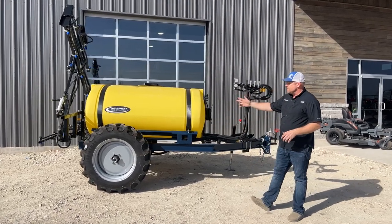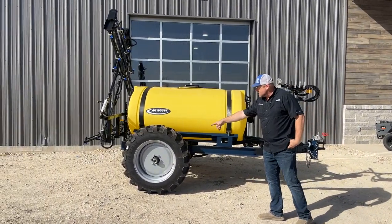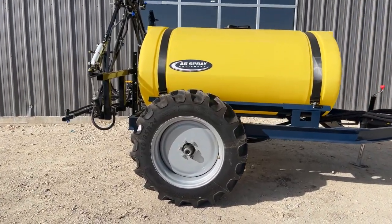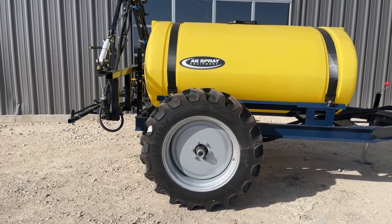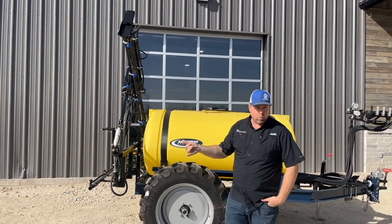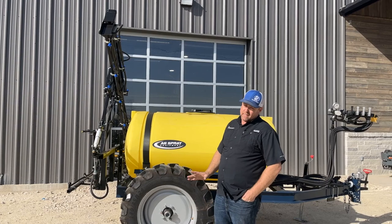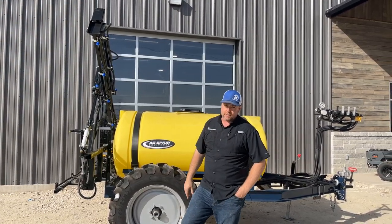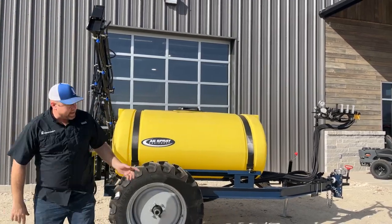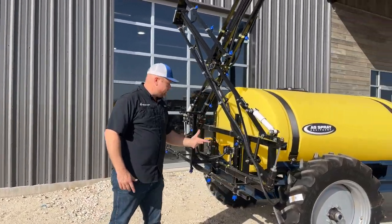This is a TR500E. It's not uncommon — you can buy these at lots of places. It does have the ag style tires, so you've got the taller style tires which ride a little bit smoother and give you a little more ground clearance. It's a relatively common sprayer. It does have the shock absorber boom — it's got a 35-foot shock. They also offer it in a 28 and a 42. For our area, the 42 is just a little bit too big. Stick with the 35. It does have the Oklahoma special kit on there, so you've got the ability to run boomless as well as the boom — you just change these valves.